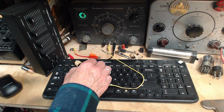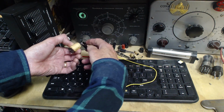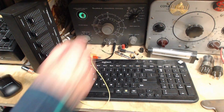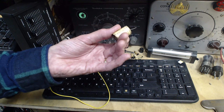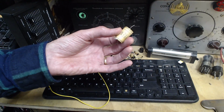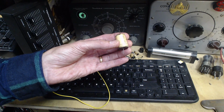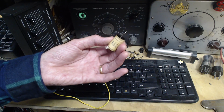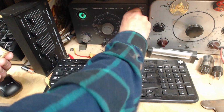I think maybe the truth is the larger the capacitor, the more surface inside it, the more there is to leak. And what goes on in there? So they try to make these out of purified materials that don't have any ions in them. Paper is often used inside these. The paper has to be cleaned fantastically to wash out any of the ions. You can't bleach the paper either. If you bleach it, then it's full of bleach ions. Is that such a thing? Bleach ions?